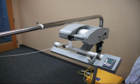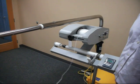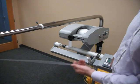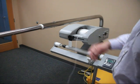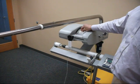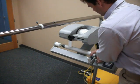Well, one indication there is quite a big run on when the rewinding stopped. You wouldn't usually see quite this much line run on when you stop the rewinder. So it's another indication that this tension is too low. Anyway, I'll take the spool off.